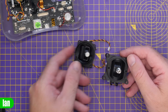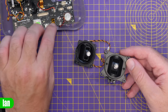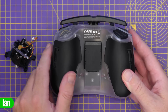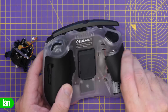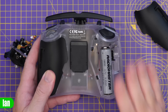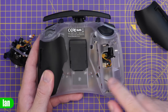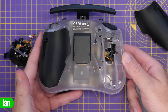Whilst you can't fit the AG01 gimbals in this radio, one nice feature is that you don't need to remove the back cover to make gimbal adjustments. Removing the rubber cover on the back gives you access to do all the gimbal adjustment from the back side. Removing the battery frees up enough space to get in there with a screwdriver to adjust the springs and the ratchet if needed.